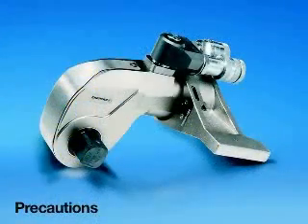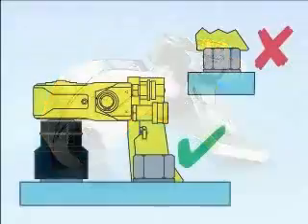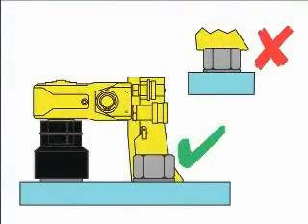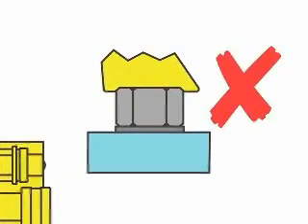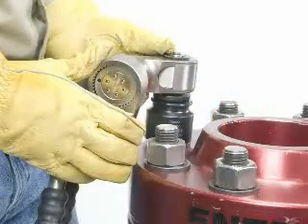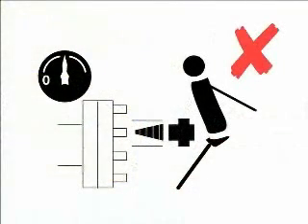Safe handling of the S-Wrench — Do's and Don'ts. Proper location of the reaction arm versus improper location of the reaction arm. Be aware of pinch points from the reaction foot. The reaction foot can pinch your fingers or the hose if you are not careful. Do not work in line with the bolt you are tightening or loosening.